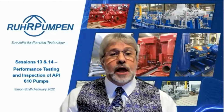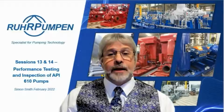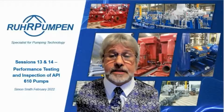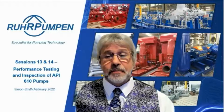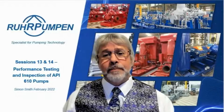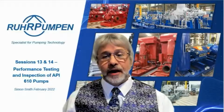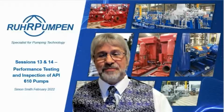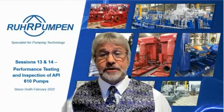Ricardo Souza says, I would like to know the best types of pump for low NPSH applications. Undoubtedly, a VS6 pump is the best pump for low NPSH applications. Next best would be a between bearings pump, a BB2, so that has a double suction impeller, and that will give you lower NPSH, but not as good as a VS6. A VS6 will get you right down to 0.